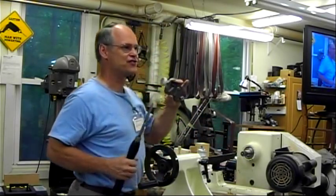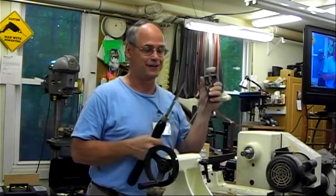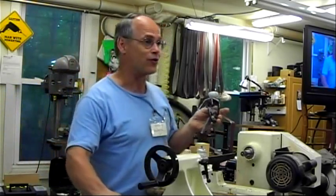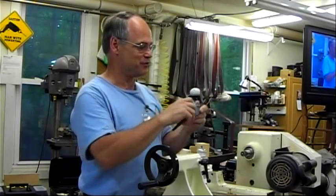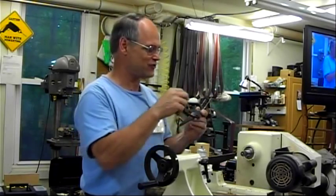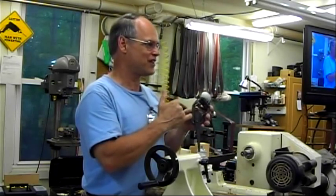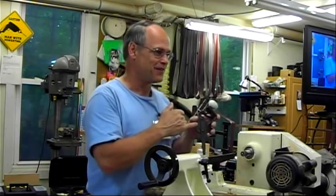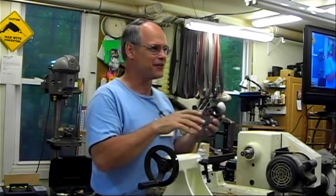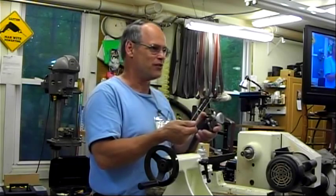How many of you have a varigrind system? Only one. Yeah, I've got it right here. And my varigrind is no longer a varigrind in that this is locked in place. It's been pulled down with pliers so you can't move. It's got CA glue embedded in the threads. It's got CA glue along here. I want that same angle every time I go. Does it matter? No. That angle can be off a little bit one way or the other. It just takes me longer to find it. That's the only difference. I was in one demo and the gentleman says that angle has to be 49 degrees.